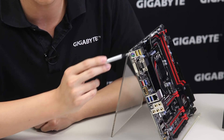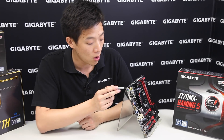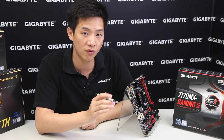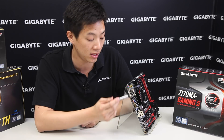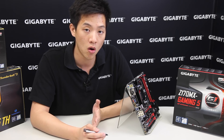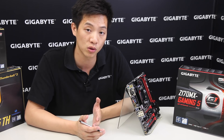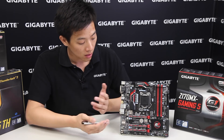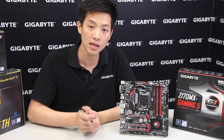The two yellow USB ports represent the USB DAC we mentioned earlier. The power grid for these two ports is separate from the rest of the board, providing a more stable power source. You can actually disable power to these ports in the BIOS, so if you want to connect an externally powered DAC or anything with its own power supply, you can connect it here. A lot of gamers like to use these ports because they provide a clean signal with less interference.